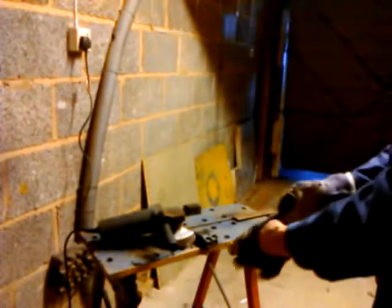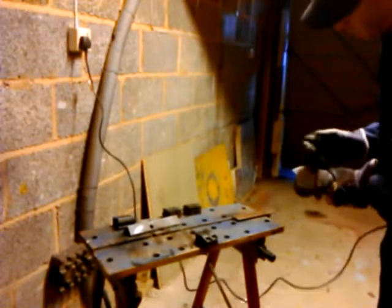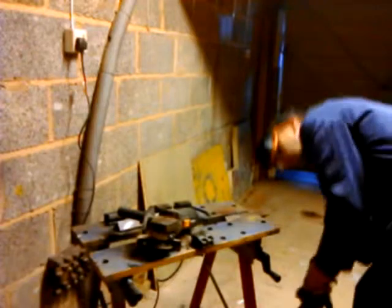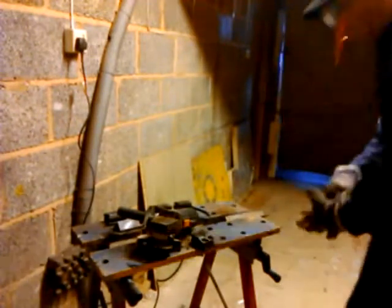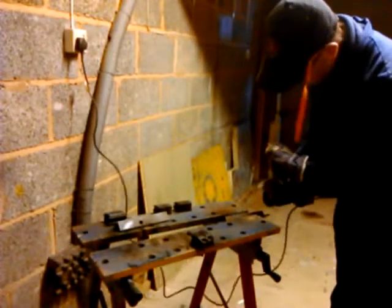First thing I need to make sure that the metal is really clean. These have already been wire brushed. You'll need to angle grind around the edge that's going to be welded. I'm going to do the inside as well. I'm also cleaning up another bit so that I can get a good earth on it with the cable.